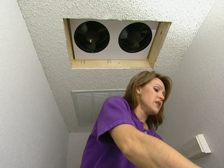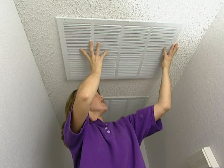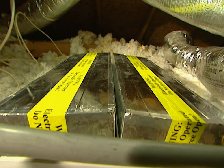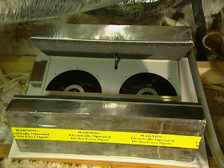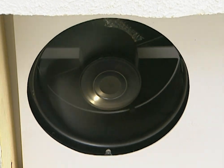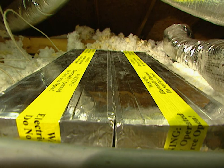The last thing that I need to do is screw this grill into place, but before I do that, I want to make sure this fan works. The fan has trap doors that sit on top and they're double insulated. Once the doors open up, that activates the switch to turn the fans on and that will draw the hot air out of your house. When they're closed, that keeps the hot air from being drawn into the home.